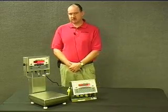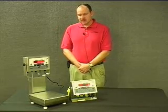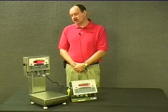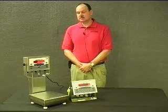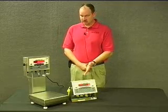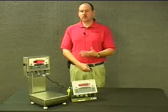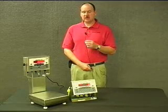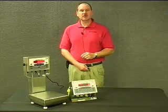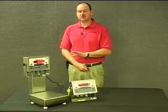Now we'll talk a little bit about the main board in the units and some of the connections and options on them. All the connectors on the CW90 or the 90X — they share the same main board — are the cage style. They're all spring loaded, so there's a constant tension, a little bit of tension put on all the connections of all the wires.